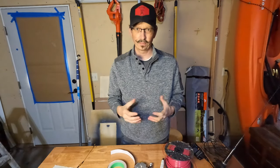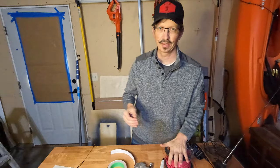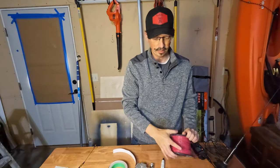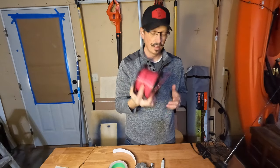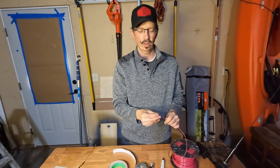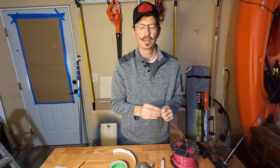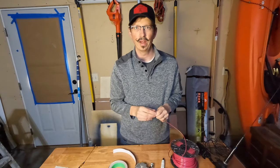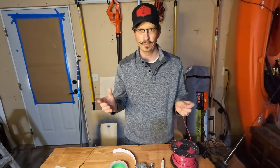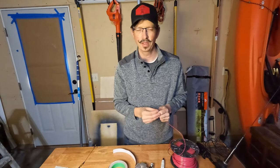You can use those commercial antennas for inspiration. Most of you are here to see how to build something. I've got some solid wire here. I like to use solid wire when working with smaller antennas like this because it will hold a shape without needing any supports, and it keeps the cost down. You can build a vertical antenna for VHF/UHF very inexpensively with just a quick trip to the hardware store.